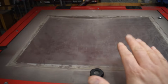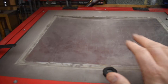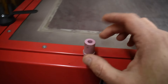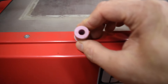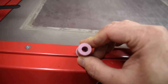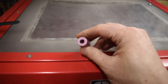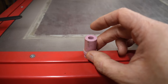You will also find that you need to change the protectors quite regularly. They get mucky — they're disposable for a reason — and they get worn out quicker than I thought. The other thing that kind of surprised me was how quickly the nozzles wear. You can see this is a number five, five mil bore. It's actually worn well beyond the size it started out — which makes sense because you're throwing abrasive through it, but I didn't expect them to be quite so consumable.